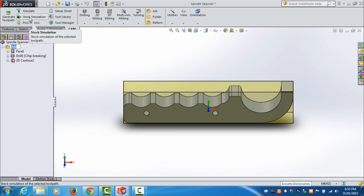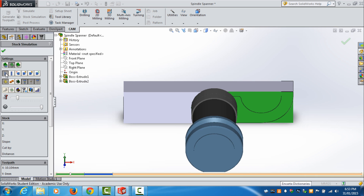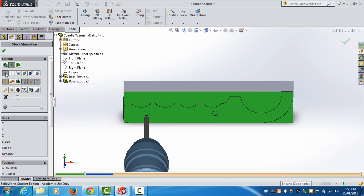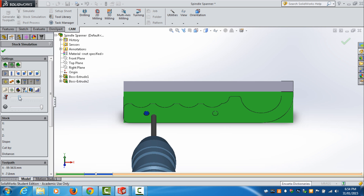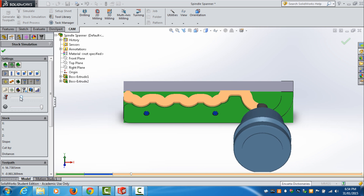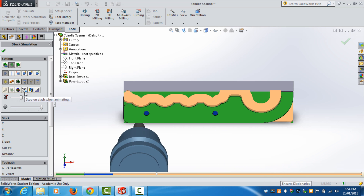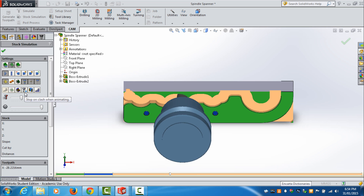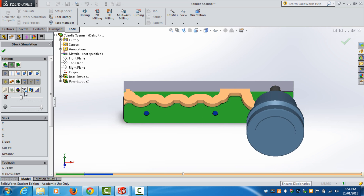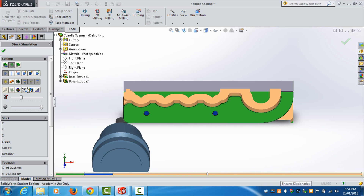We'll simulate that and this will give you an idea of my machining strategy for today. It's a simple facing operation followed by a drilling cycle with chip clearing, retracting after about 12.5mm. Then it's a 2D contour path. Now we could have done this via adaptive clearing, however I'm having a little bit of trouble trying to get adaptive clearing to work on the outside. I've tried numerous things and I'm stuck, so maybe somebody out there in the YouTube community might help me out and I'll do a video on how to do adaptive clearing on an external profile like this.